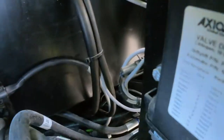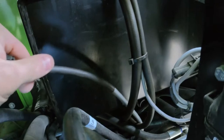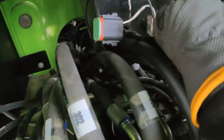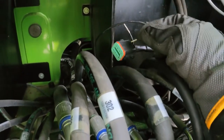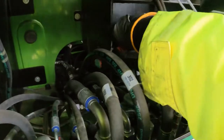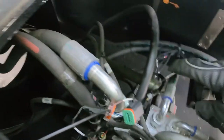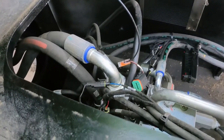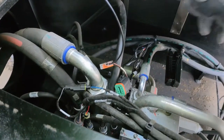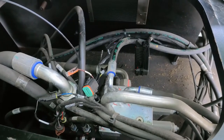I need to make sure the connection is as it should be on this wire. I removed core number 4 from the swivel joint and fitted a made-up bypass wire, because I couldn't measure resistance between core number 4 on this end and core number 4 inside the chassis. I removed that core from both ends and fitted my bypass wire in place of core number 4. I'll connect the plugs back up - behind the base box and inside the chassis - and measure resistance on the plug again to confirm I'm reading 60 ohms.